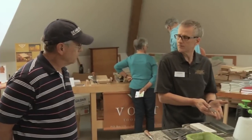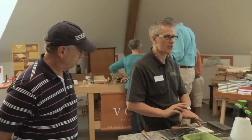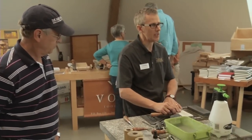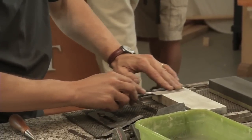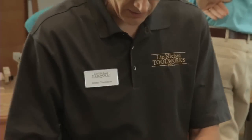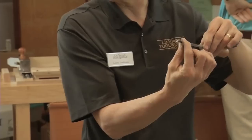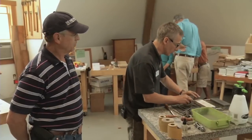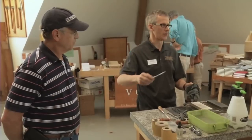When you've sharpened a chisel through the coarse stone and then the fine stone, to remove that burr you want to place the chisel flat on the stone — don't introduce any angle whatsoever. Traditionally we would have been told to remove the burr running the chisel up and down the stone, but I prefer to move the chisel back and forth laterally. When chisels go from wide to narrow, their width becomes less than their height, and moving back and forth across the stone gives more propensity to roll the blade over. Moving laterally across the stone is a safer method with less chance of rolling the blade.